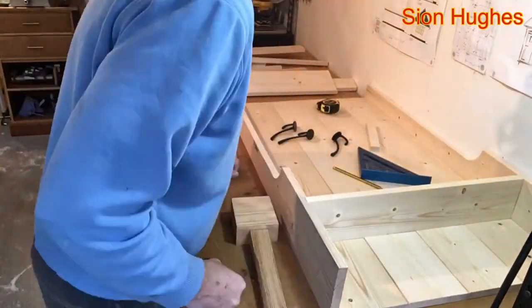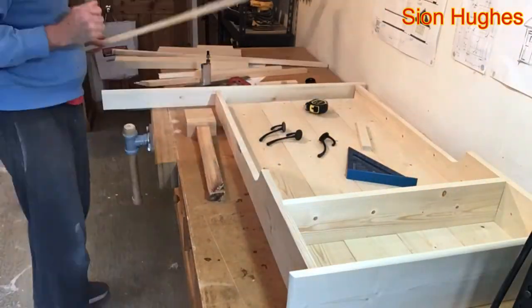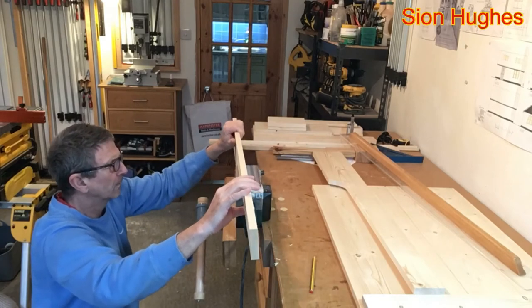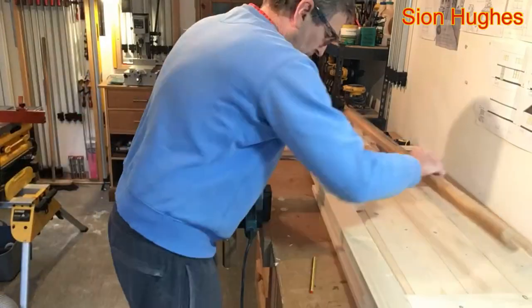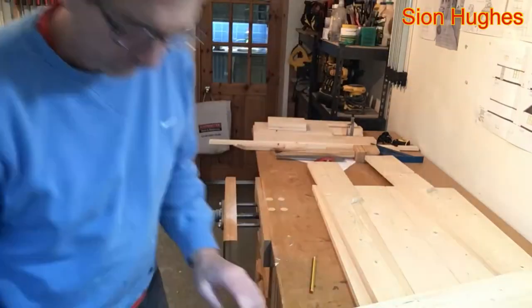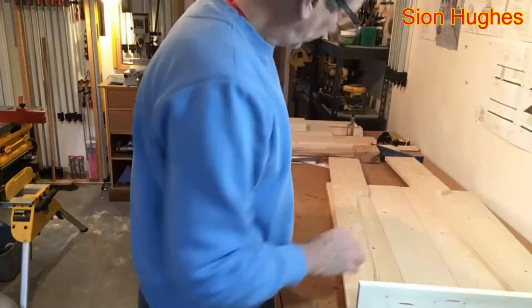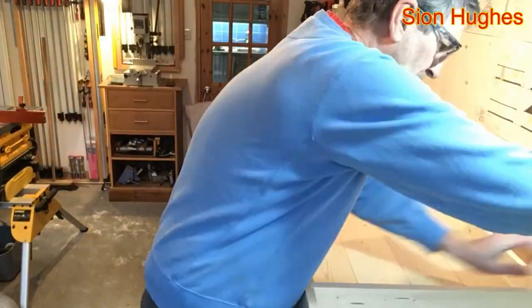It's time for a little dry fit and I'm looking at the bottom thinking about what I can do. I decide I need to finesse the sides a little bit more. I find that by placing the belt sander in the vice and taking the work to the belt sander I can get more control. With that complete, I work on the shelf - just taking the rough ripped edge and going over it with a hand plane to smooth it up, then put it back in place.